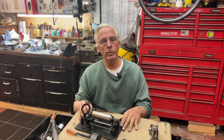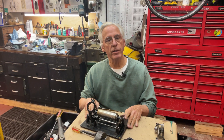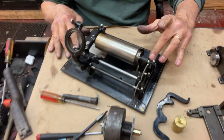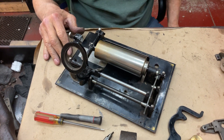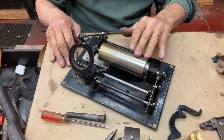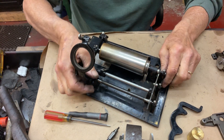Hi, Dyslexic Genius here, Brad Hurt. What I'm going to talk about is an early Edison, 1898 or so, standard and how do you adjust things on these. This is the gear train because it runs two-minute records, and this one's pretty quiet — they get noisy. Even our one clip standard we have is noisy. So how do you adjust all the play in here?